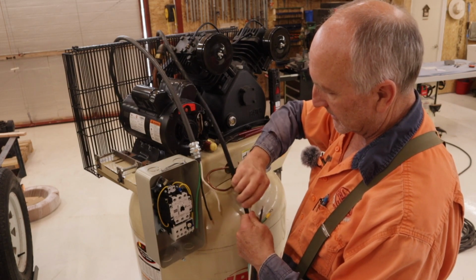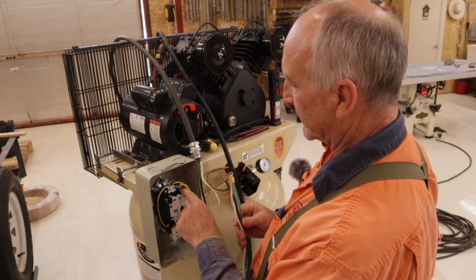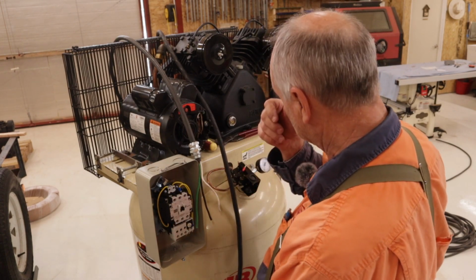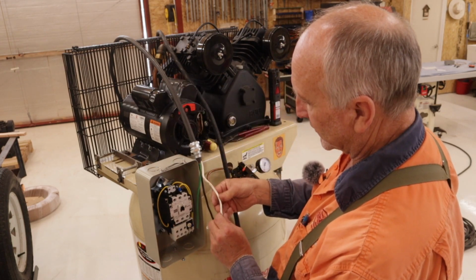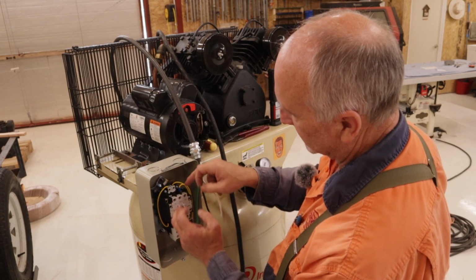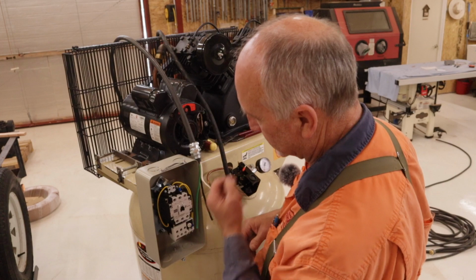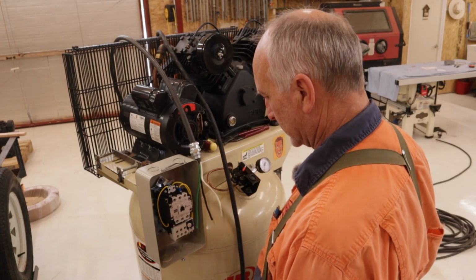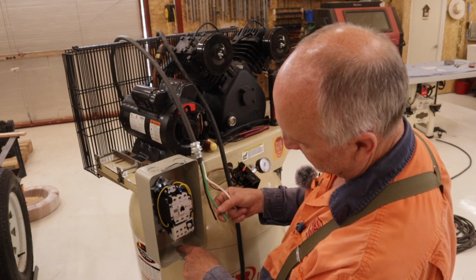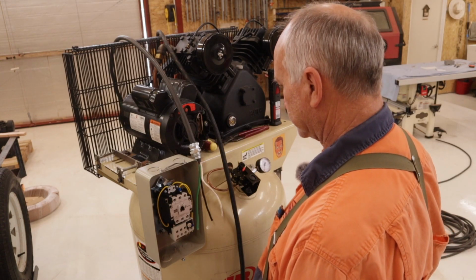One thing about the connectors here, the top of this is made to accept just bare wire. You can just poke it in there. But the bottom, I'm going to make up rings, little crimp-on rings, because the bottom here doesn't have a plate that holds it tight. It's just got a screw. So I'll fix that up. I've also got to put these earth connectors. I'll put those both down here because there's a thing made for that. Yeah, here we go.